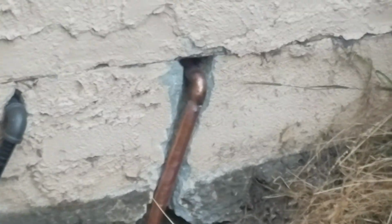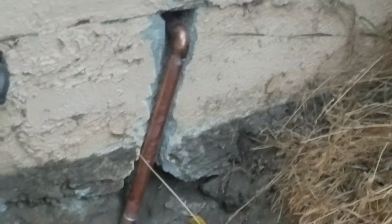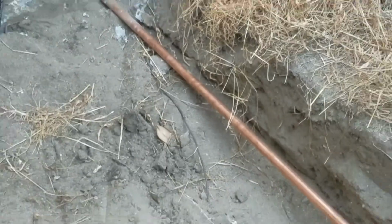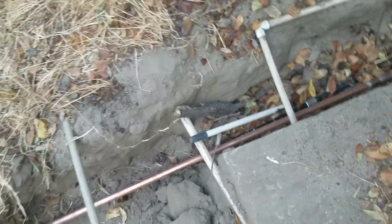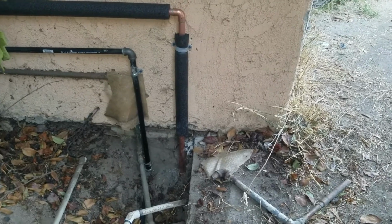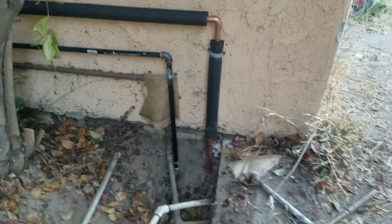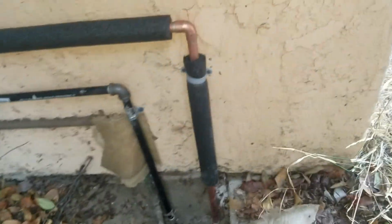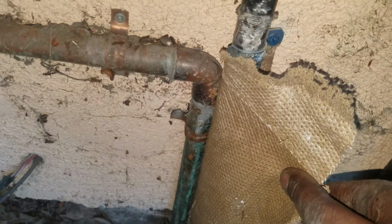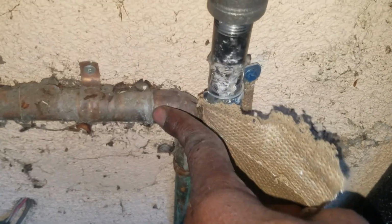From here, it comes out of the house, 3/4 inch, 3/4 inch, and then we go to underground copper. And I take that line all the way through here, taking the angle all the way up. And I also started to insulate it because I needed this to be at the proper height and distance, so I didn't make the mistake like I did with the gas line, which is, I could have used an extra, to be honest, 2 to 3 inches. So I had these really close to one another, and since that's copper and that's galvanized, that's the cold water I ran a few years ago.